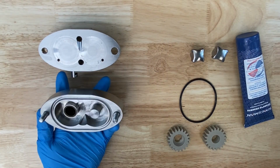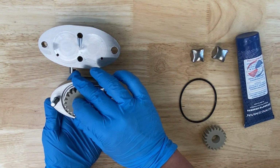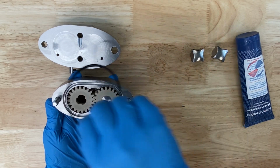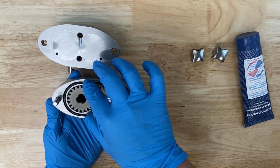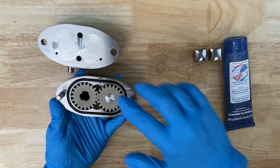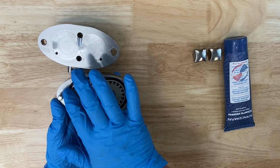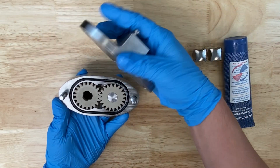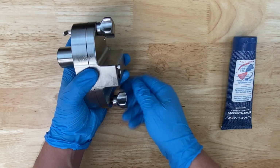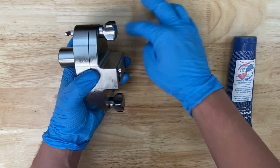Assemble the air pump assembly by first installing the gears into the shell. They only fit in one direction. Next, insert the gasket into the ridge and apply a very small portion of Spaceman lubricant. Connect the covers in the shells, ensuring they fit flush, and secure with the hand screws. It's important to have a flush seal in order for the air pump to work correctly.